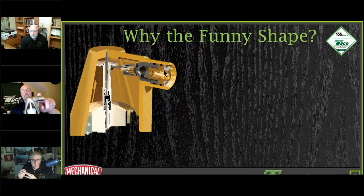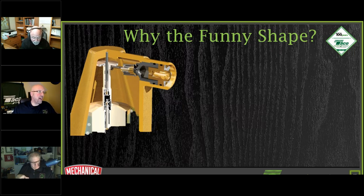And then the outside of this is machined. So if you wanted to put a hose on here or tighten it down hose clamp wise for your drain pipe. But the shape in here is designed on purpose to maximize the amount of air and keep air actually in the vent itself. Because of the valve and the hinge mechanism up here, we want to keep this relatively dry.